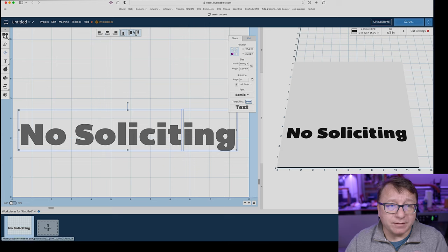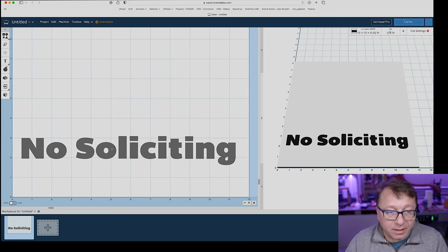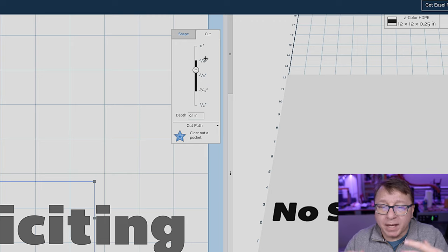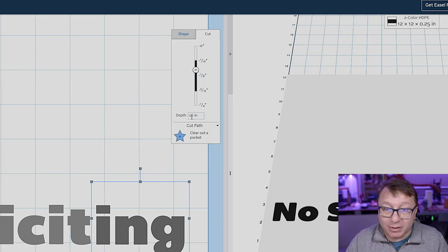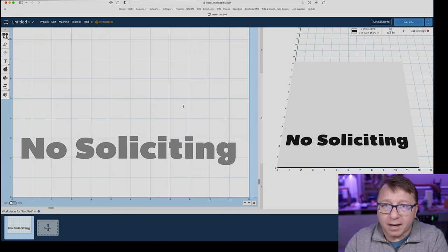When you click on a font element here, you get a little pop-up to align them — you can align to the left, center, or right, and also baseline, middle, and top. I just aligned to baseline so they're on the same line. Now that we have our two pieces of text, we need to check the depth of cut. Clicking on the first one pops up a window with Shape and Cut tabs. Shape lets you adjust location, size, font, and other aspects. Cut tells you how deep it wants to cut — in this case 0.1 inches. I'm going to go with 0.07 for both pieces. You can see that the cut preview on the right-hand side is black, because it's milling away the white portion — that's the advantage of setting the material properly.